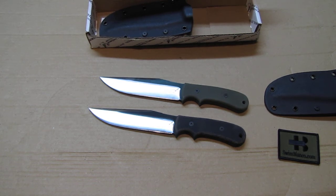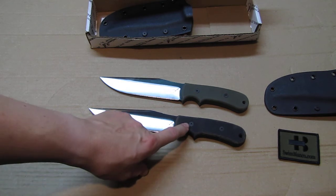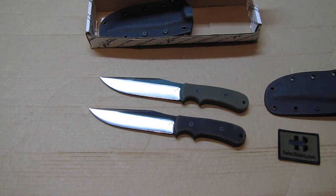Just to point out the key issues: the grinding near the handle needs to be fixed, and the screws should clamp the handle on the tang really well out of the box — there should be no wiggle, because military users or others may not have the tools to fix it easily like I do. They should also apply a bit of Loctite to the screws from the factory, because if you're out in the field overseas or in the forest and you lose a screw, the grip will start wiggling and you'll be in trouble.